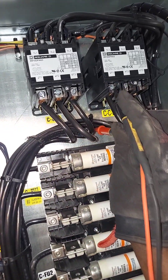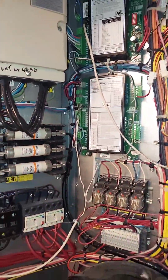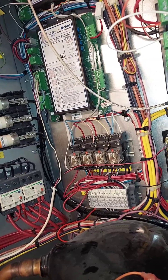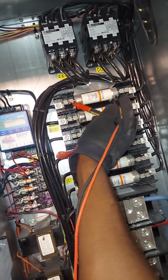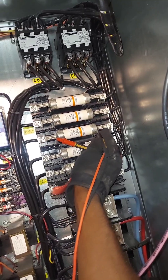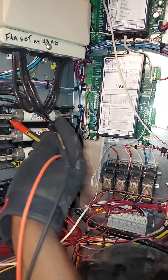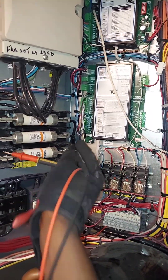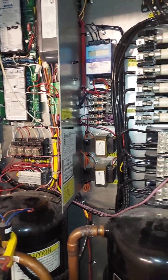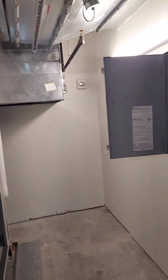The VFD drive is on the main fan motor, so if that's a problem we've got fuses there too. The compressors also have fuses — let's check those, they're good. It looks like it's just a problem with the main fuse, maybe a power surge. We've got fuses on the VFD drive too — these are good. The drive itself is a protector — it will gently shut down the load if there's a problem before it gets back to the main. You just need one fuse — that's the diagnosis.